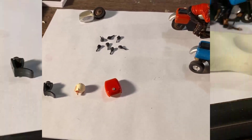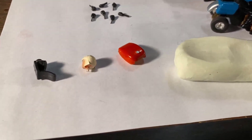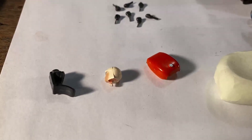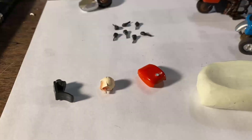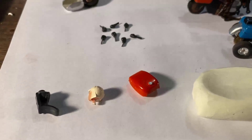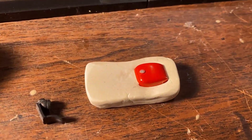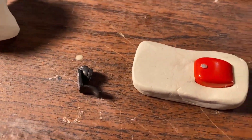I just got my clay out and I'm making it a bit more pliable. You'll notice all the pieces have a mold line on them — there has to be a top mold and a bottom mold. I'm going to do my best to use the same mold lines that Aurora used when reproducing these parts. Just got the clay pliable and pushed the cast tank down, and I'll do the same with the front fender and light.